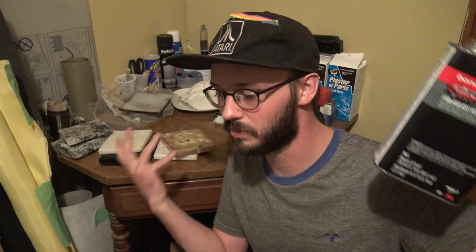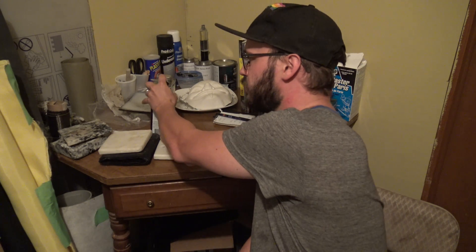The resin I used was quite literally the cheapest resin you can find either at a hardware store or even online. It's this Bondo polyester resin. It's only really used for small repairs and simple lamination. But as most polyester resins are, when you want strength you're usually going up to an epoxy resin, because that structurally is a lot stronger and makes a better plastic in general.